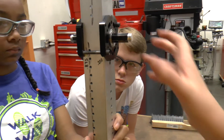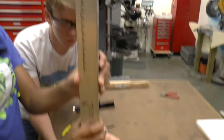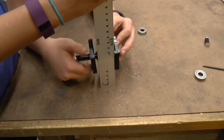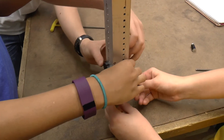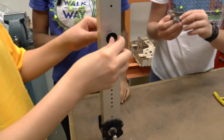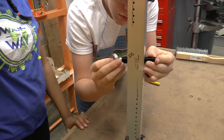Check whether the carriage is still loose enough to slide — you want it loose enough to slide. Now do the bottom one, which makes it easier to get the bearings in. Being able to slide this will help when there's an actual gearbox installed. The bearing on the outside is the real bearing; the one on the inside simulates the gearbox.